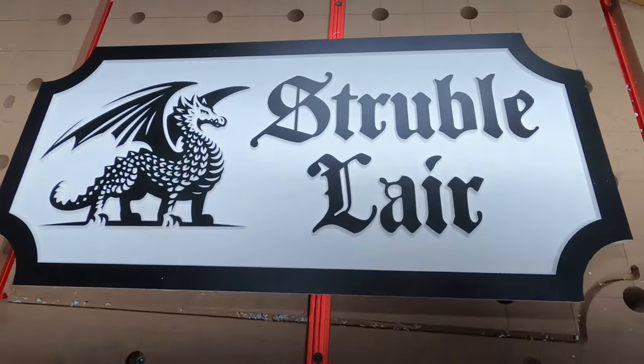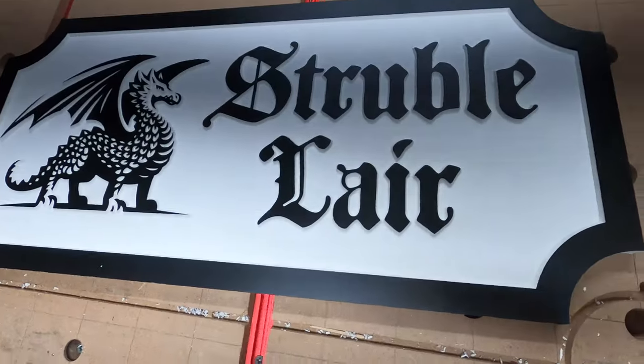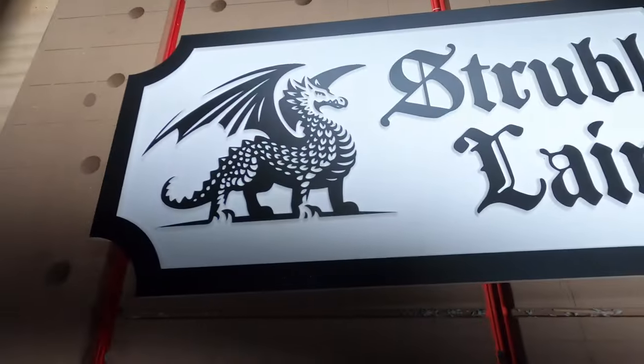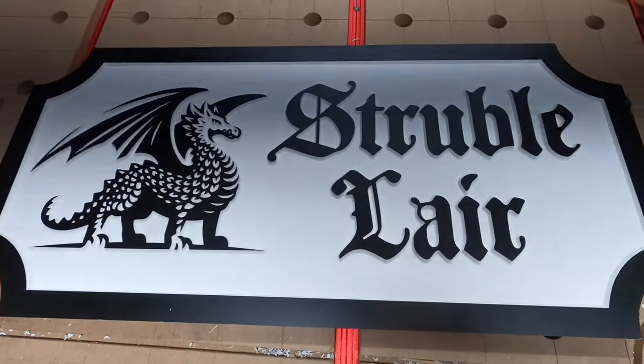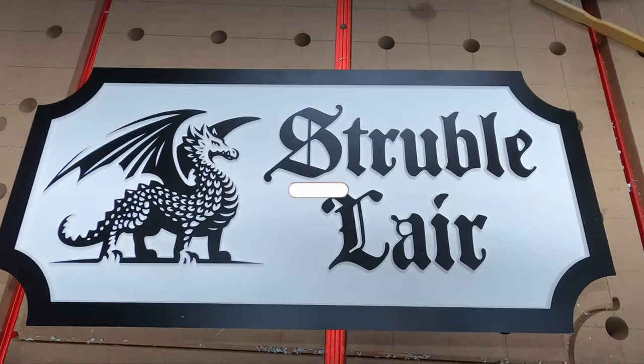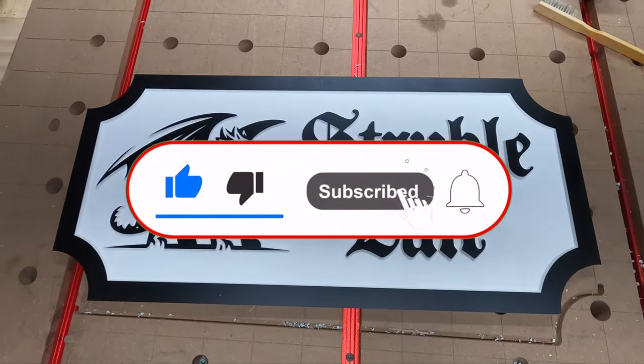But doing the V-carve first was definitely the trick to eliminating at least 90% of the fuzzies that are left over that you have to clear up. So if you're doing this, try doing the v-carve first. I'm telling you, it was really great.